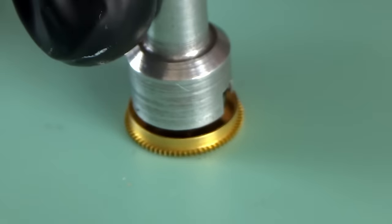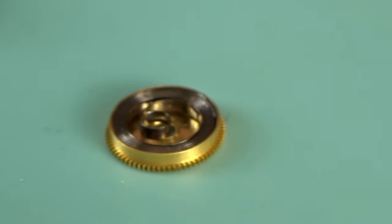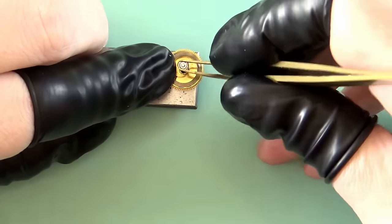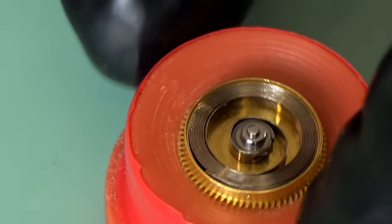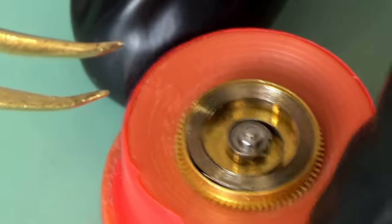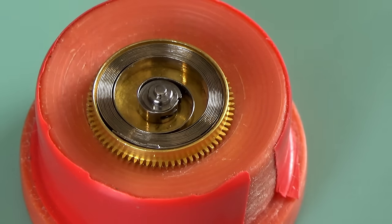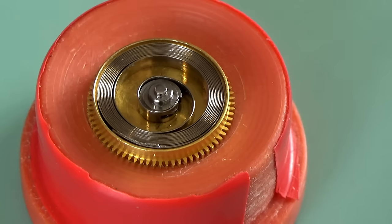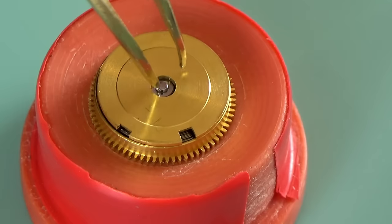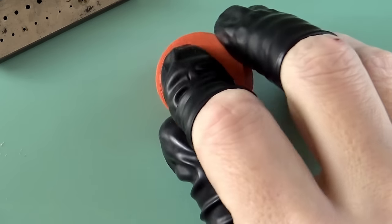The bottom of the barrel will also take a tiny bit of grease, since it's not really possible to oil the middle run of the spring - again, less is more, from commenters' suggestions. I am a watch collector that started transitioning into finding out what it would be like to actually make and work on watches, so I am no expert. The barrel arbor was a total pain to get in. With the hook in the right place in the barrel, I'm using a 3D-printed barrel lid press to press the lid on with even pressure.